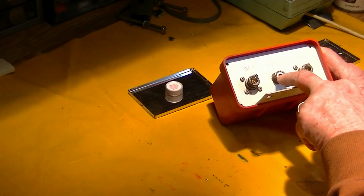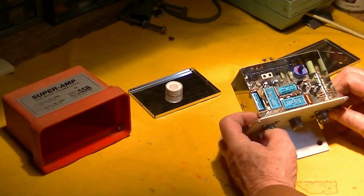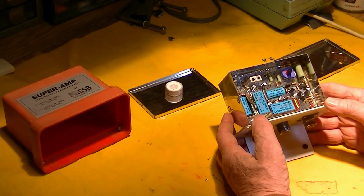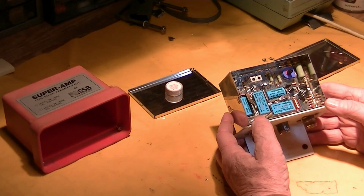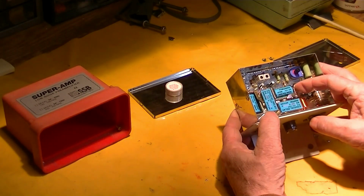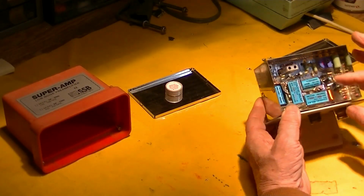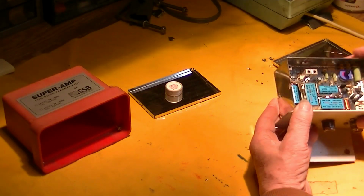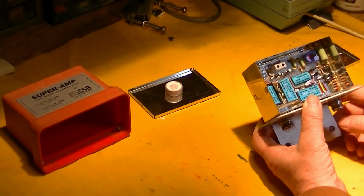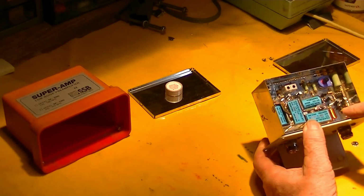Transmitter, antenna, and 13.8 volts to power it, and also switch it on and off. This thing is RF switched up to, I believe, 100 watts. And if you hard key it, it'll pass up to 750 watts, so they say. Two nice little Japanese relays in here. External coil, but this is the coil part of it, and then here's the arm pushing on the little thing, and the contacts are inside. Very much the way a Dow-Key works, but these are VHF, UHF rated, and very nice.